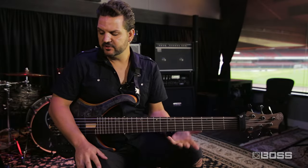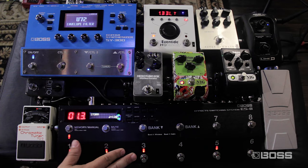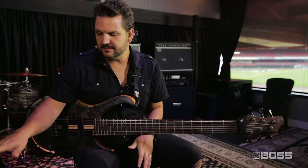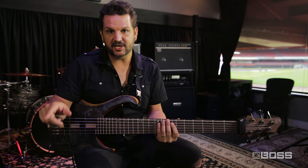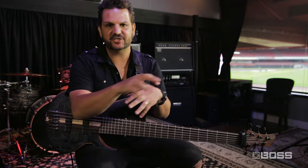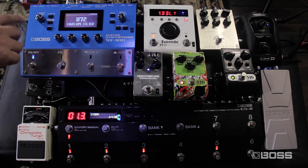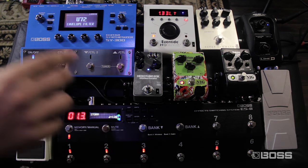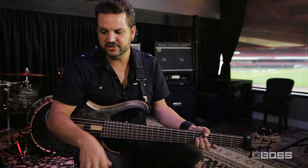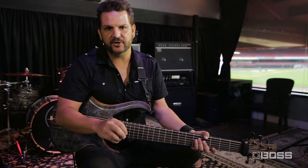In patch number three I have my compressor, my preamp, my chorus, and my delay. Not only did I create this combination, but I also sent a MIDI message to the H9 telling it which channel I want. You can use up to eight MIDI channels on the ES8, meaning you can control eight MIDI devices. You simply daisy chain the MIDI devices — for example, my MIDI cable goes into the SY300 and from there it goes to the H9. I have the H9 on MIDI channel two and the SY300 on MIDI channel three.